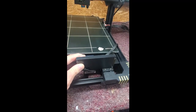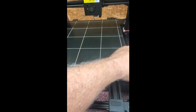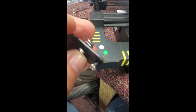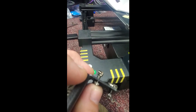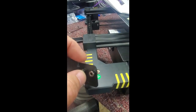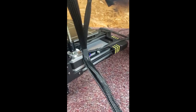You're going to take the monitor or control board out and flip it around, then put it over here on this rail so the bed can slide back and forth without hitting it. For those that don't know, the flat part of the T-nut faces out because that's what's going to grab the edge of the inside of the channel. You just want to put it on just a turn or two so you've got that space and it'll go past the edge, then turn when you tighten. That's why it's shaped at a slope there. Then this is going to go 140 millimeters back along this edge to support the filament.